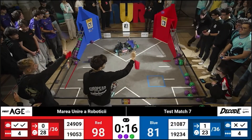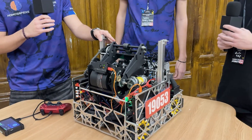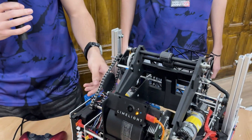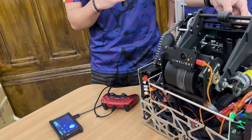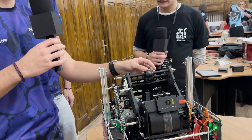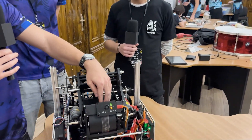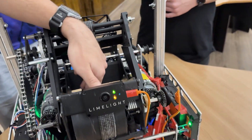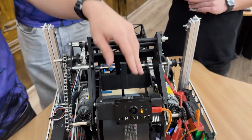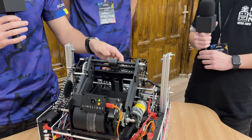Talking with you, Aldea, can you please showcase your shooter? The shooter is the most iterated part on our robot. The first key feature is these counter rollers back here, powered by the main two 6000 rpm motors — the counter rollers reach about 18,000 rpm. They help us reduce backspin and have more accurate shots. Our flywheel is really heavy, so we keep inertia when shooting and can shoot in fast succession. Our main flywheel that makes contact with the ball is aluminum and the rest is printed, reaching about 600 grams. We also have a hooded shooter to adjust the angle so we can shoot from both the close zone and the far one.